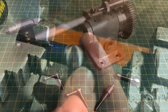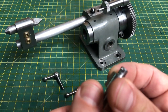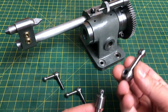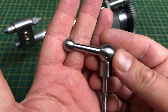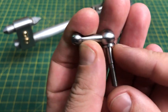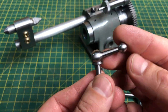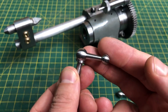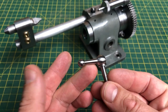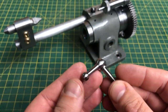The shaft looks good, and off camera I have machined a flat onto the spigot to receive the grub screw in the handle. I worked out where to put this by trial fitting the shaft in the dividing head and simply marked the location with a sharpie. The handle itself is assembled and it fits nicely onto the shaft. The small handles are also done — the plans call for a simple straight screw on these, but I have taken the time to make a stepped screw similar to the large one. Firstly, I think it looks better, and secondly, these handles are held on with Loctite. If the step wasn't there, when tightening these, the joint would be stressed in two directions — both rotationally from the handle movement and also axially as the screw tries to jack itself out of the socket. You may well prefer the look without, and the strength of Loctite 603 means they would almost certainly be fine. Anyway, let's get this assembled and see how they look.